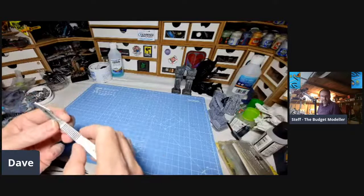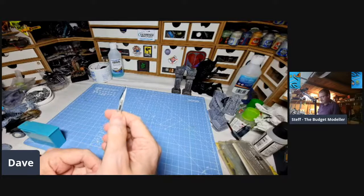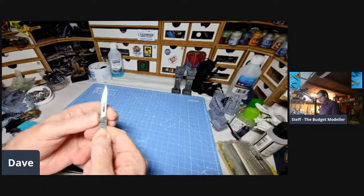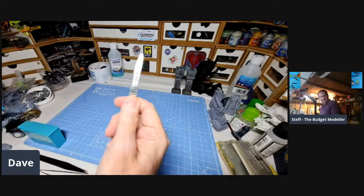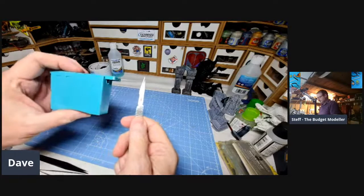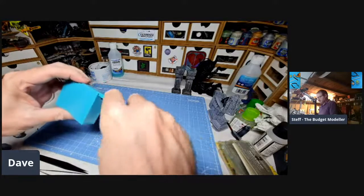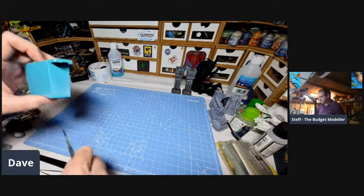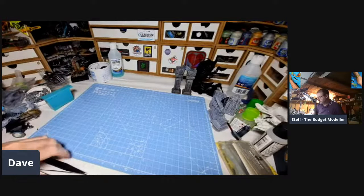Plus, if you slip, the drag of the pad will hold it back where a wooden block won't. And that brings me on to scalpel blades. I personally really like the Swan Morton scalpel blades because they clip on very securely. The barrel-shaped ones can easily roll off the bench. Swan Morton sits very nicely and firmly in your hand. Another useful thing to complement that is a blade safe — when the blade's finished you stick it in there, twist the handle around, and it just stops you stabbing the bin men, basically.